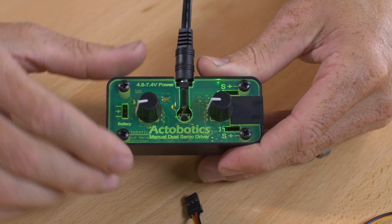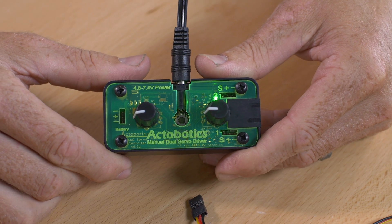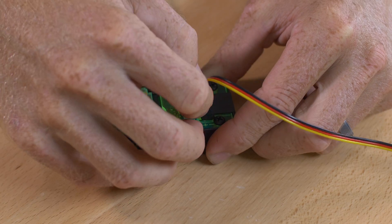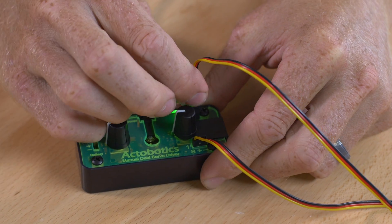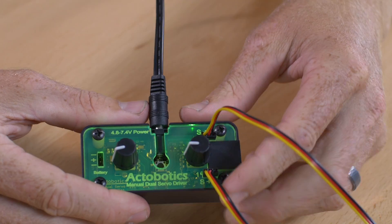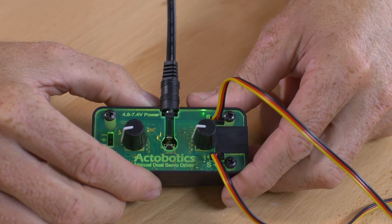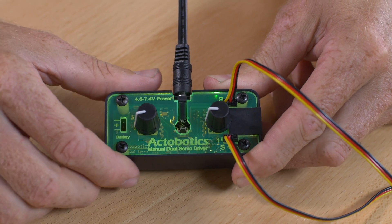As you can see when I plugged in, the green LED lit up, and that's an indicator that it's getting power and it's ready to use. Next I'm going to plug in the servos. The servos have slots in the front you can plug into there, or if you're running long distance, you could plug in a Cat 6 cable to the Cat 6 port off the side, and you can run down to our boosted board and plug in there, then plug your servos into the boosted board.